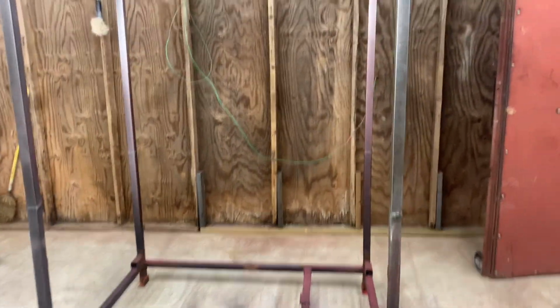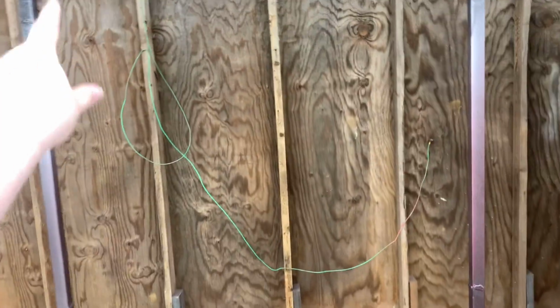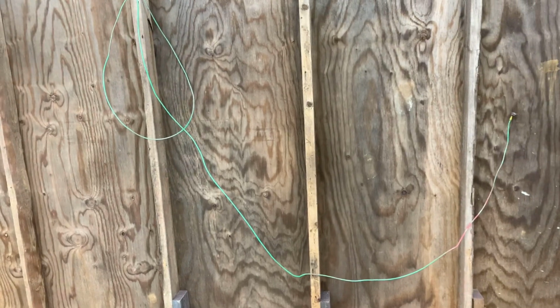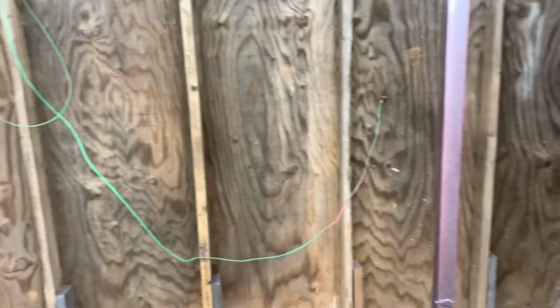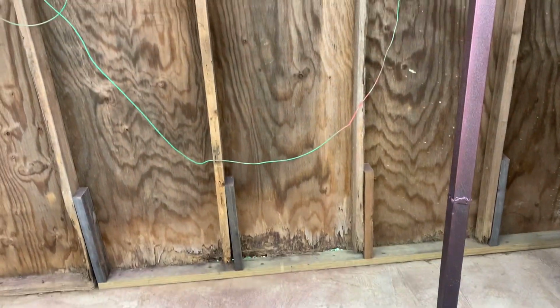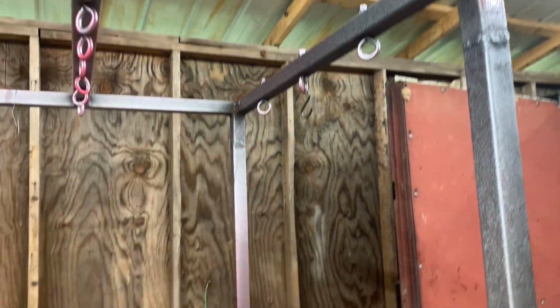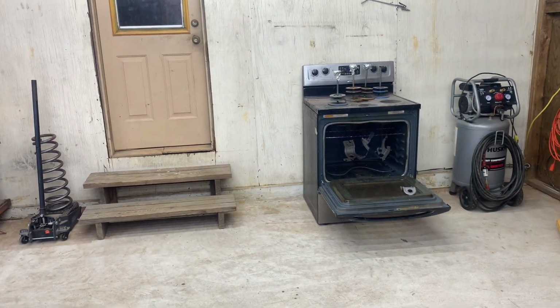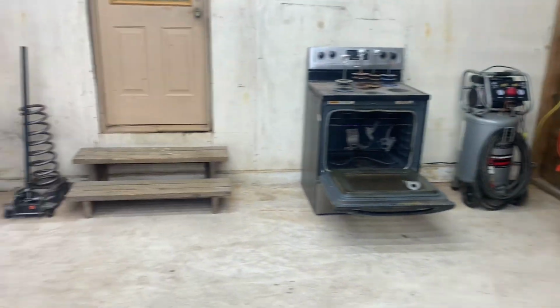We have our rack out with our earth ground. That's what this is. It's for our earth ground. This is where we were going to put our booth. That's why that's there. But now that I parked the 300 in here, there's not going to be a booth go here. So we're going to figure out somewhere else. We're going to build a new shop at some point to put this in. So this is all very temporary. But this has a bolt welded to it for our earth ground. So we drug this out. We can hang stuff here, powder coat it, and then move it into there. And that won't be an issue. Or I might take that rack out with all the parts hanging on it and then hang it, I don't know. We'll see. We'll figure something out.